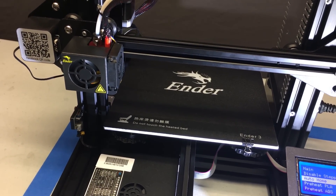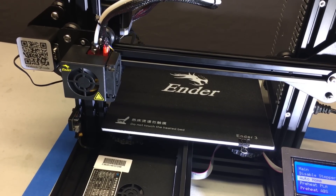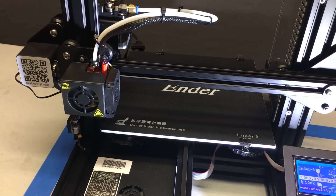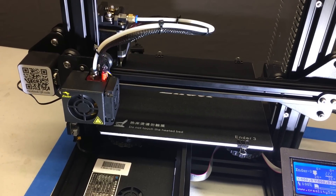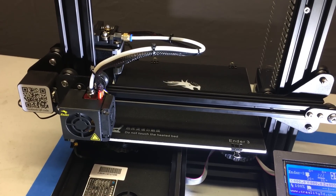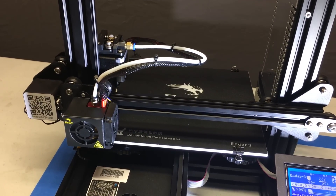You're only going to do maybe two rotations each and keep going around in a circle. You can't fully decompress one corner without doing the other, so you need to do them in sequence. You want to get the bed about one millimeter under the nozzle — that's key — so do them in sequence, a couple turns each, and keep going around until they're all up.